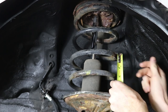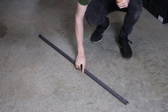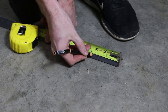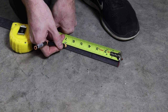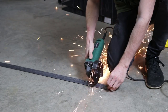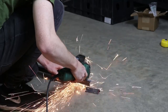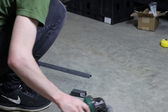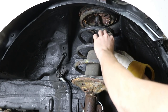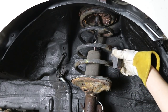The top of one coil to the bottom of the next coil is a little bit over three inches, so we're gonna go ahead and mark three and a quarter inches, and six and a half. Perfect size. There's a little bit of overlap on both the top and the bottom. Weld these two — they're really warm — together, form a box.